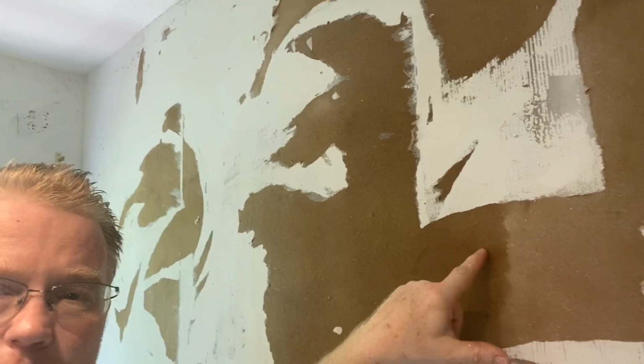So, in order to treat sheetrock, either to prime it, or paint it, or wallpaper it, you have to seal it. This has to be sealed. Now, that's sheetrock right here. That's perfect. This is the paper underneath the gray or white shell. In order to paint or wallpaper over sheetrock, you must seal it. I didn't say prime, I said seal it.